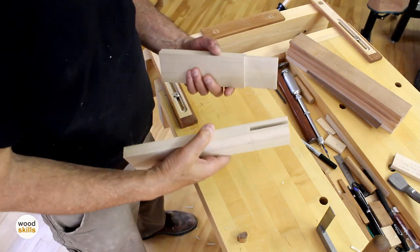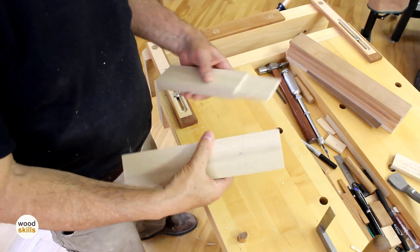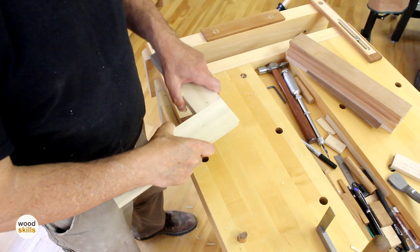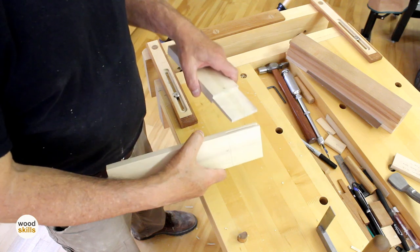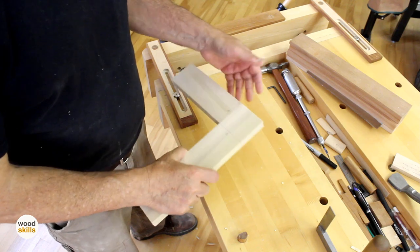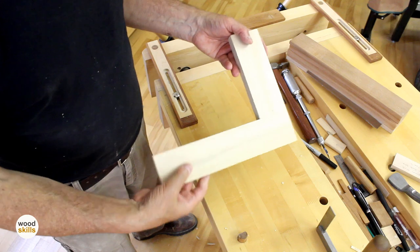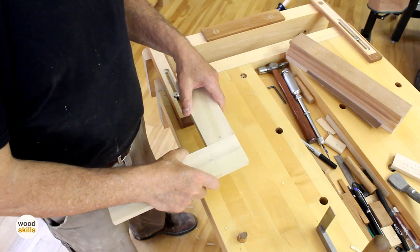Well, it's a fairly straightforward joint to make. Not complex at all. It's very understandable. There aren't any 45 degree angles involved, although there is a 45 degree version of this that I'll probably be doing in my next video. And it's a very, very strong joint. There's plenty of long grain surface contact, and the glue will reinforce that, and it's probably one of the strongest joints. It's just an open mortise and tenon, so it's not housed, so it's a lot easier to create the mortise. So a bridle joint, great for frames or construction or stands for cabinets.